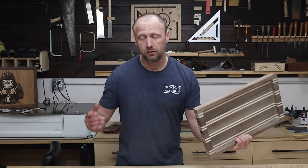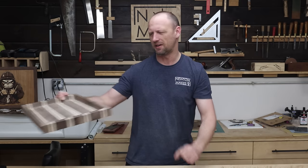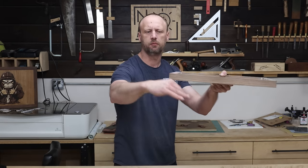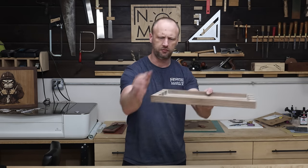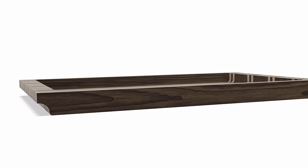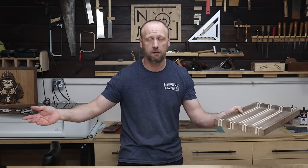I did a lot of routing and a whole lot of sanding, but it looks pretty good. This needs handles — two handles. I'm making this up on the fly. I'm thinking maybe something that curves and mimics the inside, but curves up. So I'm going to go over to the table saw and remove some material on both ends, then go over to the router table and do a round-over that rounds down towards the bottom and also a curve that goes up towards the handle — so it makes like an S profile. We'll figure it out.